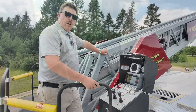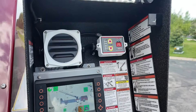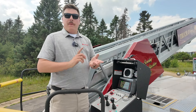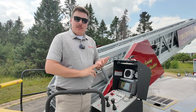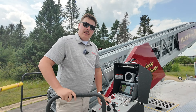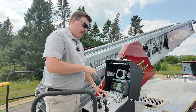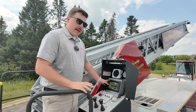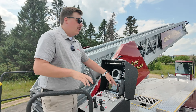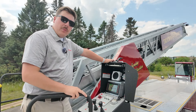Up at the pedestal of Stockton's Truck 3, we have the optional three-lever system — don't be fooled, this is still the Rosenbauer smart aerial system, just with each movement on its own individual lever. All the favorite features like soft stop, collision avoidance, and short-jack operation are still included. The aerial smart screen up here has three key differences: you can control aerial speed, auto bedding, and tip controls. When the tip control function is held, the person at the tip of the aerial has authorization to move the device as long as the pedestal operator is pressing that authorization button.